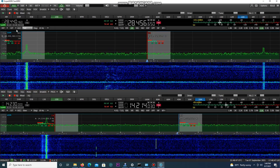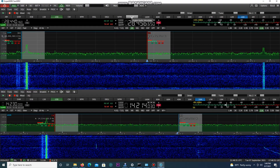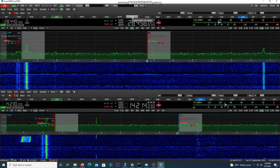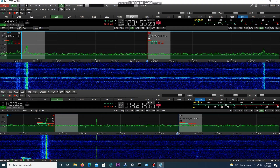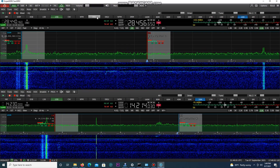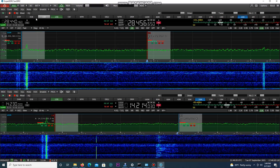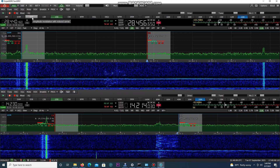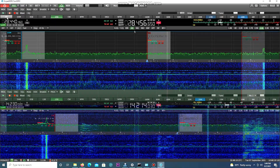There are other things I'm dying to try out — like digital radio DRM, which is digital shortwave broadcast from different shortwave stations. You have wide FM, digital upper side, digital lower side — so it's digital-ready. Narrow FM, CW, upper side, lower side. You have amplitude modulation with a reduced carrier, synchronous amplitude modulation, as well as standard AM.